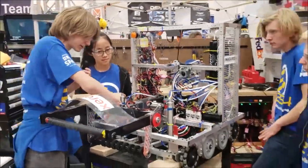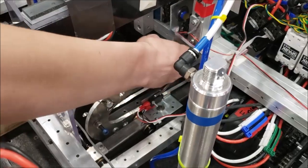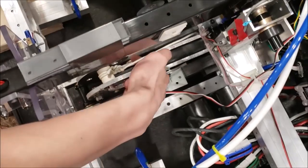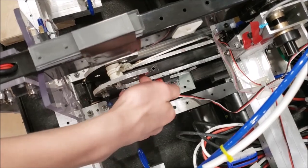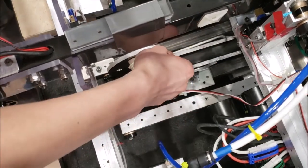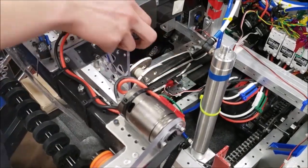It took a lot of iteration to get this working because it deals with crazy amounts of force. We had to go through a bunch of different versions with different materials. You can see the most weight-bearing bars are made of steel. These were roughed up on a bandsaw, but we have other ones — these plates — that are CNC'd as backups. And we have a limit switch to stop it from pulling itself to pieces if it keeps trying to actuate.